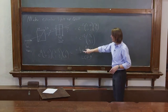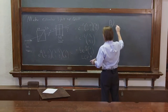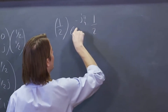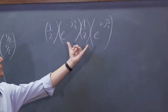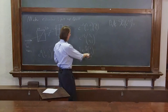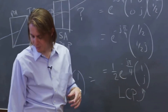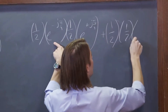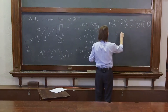So let's think about what really got through. It would be each component times its complex conjugate, summed. The top part is (1/2) · e to the minus j pi over 4, times its complex conjugate (1/2) · e to the plus j pi over 4 — those exponentials make e to the 0 equals 1, so that part is 1/4. Then for the bottom, you have j times minus j, which together also makes 1, giving another 1/4. So the whole thing together is 1/4 plus 1/4 equals 1/2.